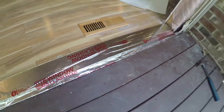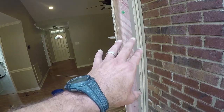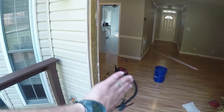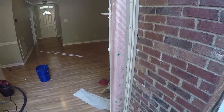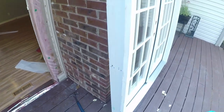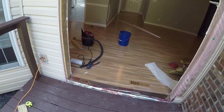And we've got this J channel and siding out. When we put the door in, we're going to come all the way here. It already goes up there just right. And we'll put our channel in, like I said, and tie it all back in. So now all we got to do is set the door in, plumb it up, and install it.